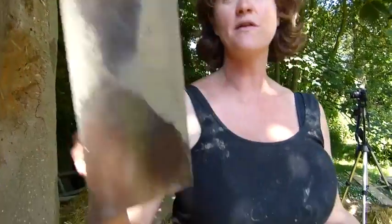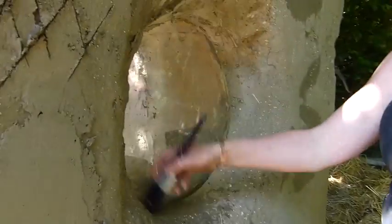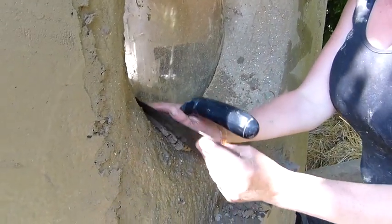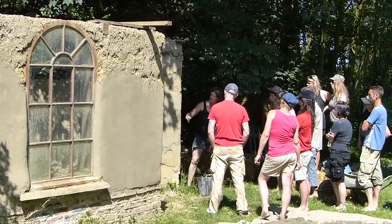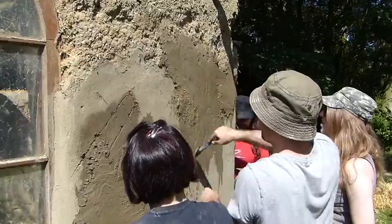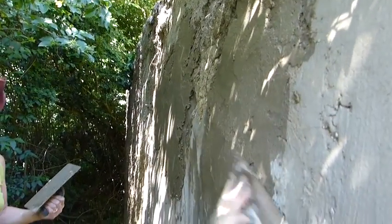To me, this is the joy of life — going round a window with plaster, can't get much better than that. We're just going to literally slide it on. When you're doing curves, a brush is your best friend because you can brush on at lots of angles. You can literally start it off with your hand and then slide it on with a trowel. Just literally sweep over and keep the trowel wet.